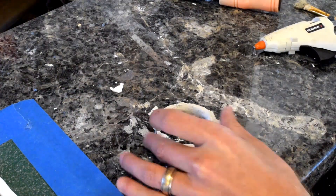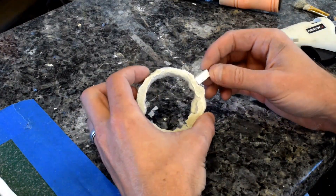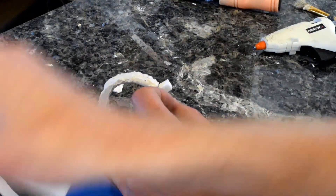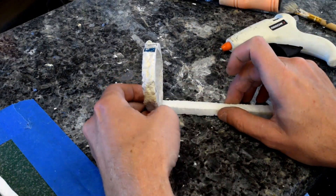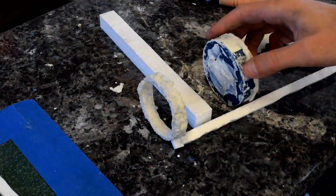The next step of the process was to get the sprues taken care of. Because I wanted to save time and cast these together, I built kind of a T-shaped sprue channel. The difficult part was the output ring gear — because of the outside being keyed, I had to cut a smaller piece of styrofoam that would fit in between each of the keys, so that when I cut off the sprue later after casting, I wouldn't mess up any of the keys.